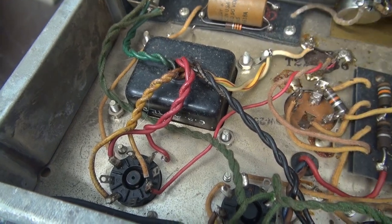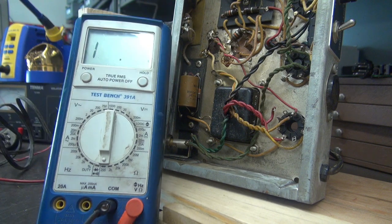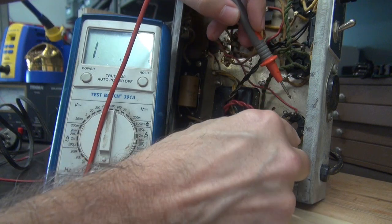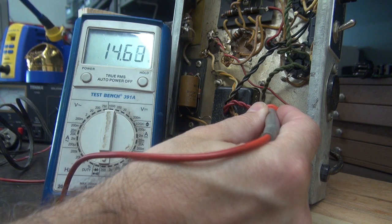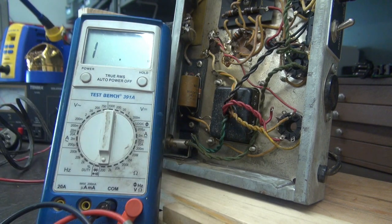I figured there's probably something wrong with that transformer, so let's measure it. To make a long story short, I hooked the amp up to my variac because I knew it had a short, brought up the voltage, and it was drawing excessive current. So I measured the high voltage windings — I only got about 44 ohms on that winding, and going to ground that side is 30 and that lead is 14. So we've got some internal issues with the power transformer — it's leaking to ground. Those resistances are way off, so the power transformer will have to be replaced.